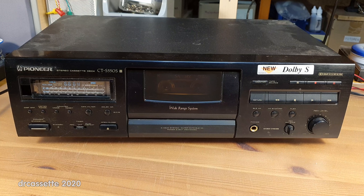Another issue is with the quality of recordings. They sound absolutely terrible. Simple reason, there is dirt on the record head. Only on the record head, and it does not want to come off. I got some of it off, and that has already made a major improvement.